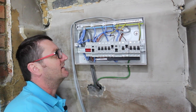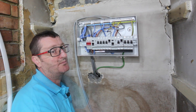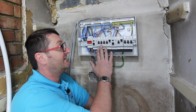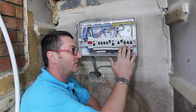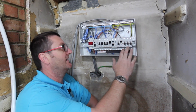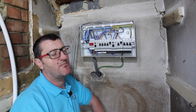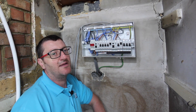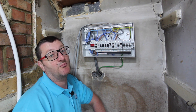With eight circuits I'll have four on each side, and I split my rings and my lights up. I'll have the ground floor ring on one side and the ground floor lights on the other side, the first floor ring on one side and the first floor lights on the other, and the same for the loft. I split them up because if you're in the bathroom on the first floor and the lights go off, there's still a potential that you've got a light plugged into your sockets so they won't go off and you're not in complete darkness.